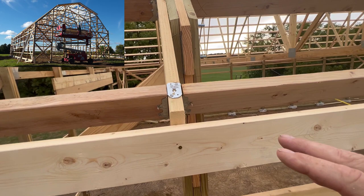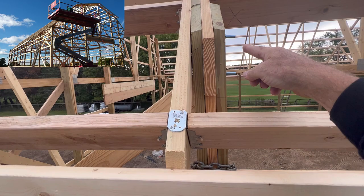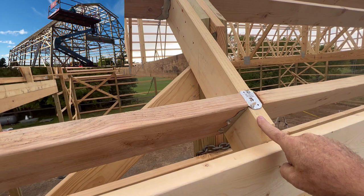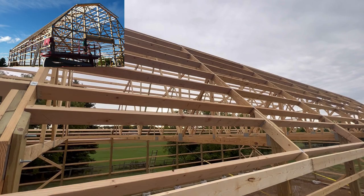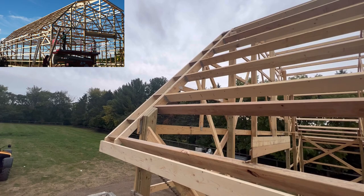Let me bring you up here to see how this detail works. You can see the boards we cut earlier to set the height of our post, and then the little slot that the truss comes into. We through-bolted these three with carriage bolts. To get our tails, we use a small block there and cut these for the tails and fascia. We'll put tin on the bottom side and the soffit will go on there. It's getting to look a lot like a building — you can see the ladders all the way up.